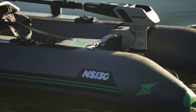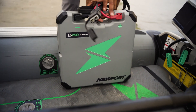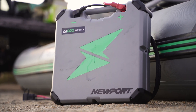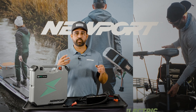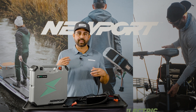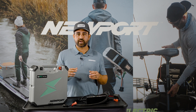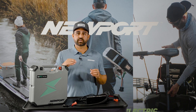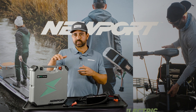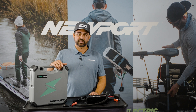After you've run your battery over a day on the water, you might be offloading on a sandy beach or in mud — inevitably you may have some salt, sand, or mud in and around the top surface where the terminal connectors are. To keep the internal environment of the plug clean and totally free of corrosion long term, I like to leave the plugs intact, rinse with a water mist, dry off that area, and wait until the area around the plugs is clean and dry before I unplug and plug the charger in to top off the charge. This keeps that entire area totally clean and dry, and you don't risk getting anything inside the plug.